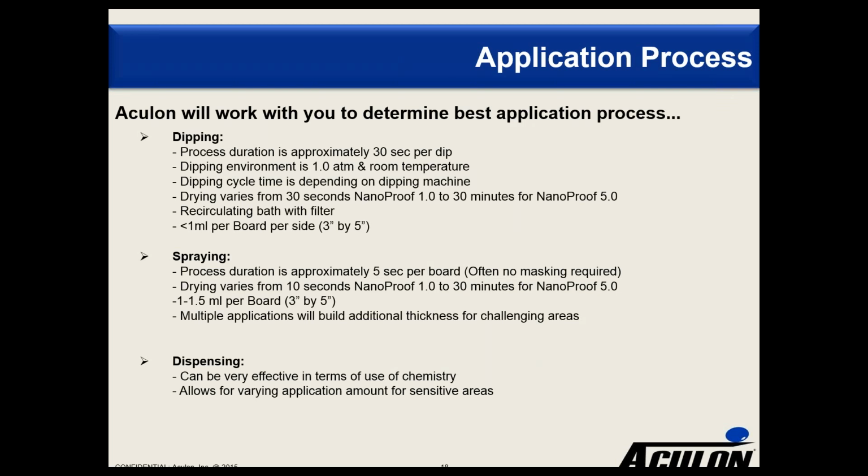Depending on the part to be coated and the manufacturing process you employ, NanoProof series is adaptable to dipping, spraying, and dispensing. Dipping is typically done with a 30-second dwell time at ambient conditions. Drying time varies by the NanoProof solvent, and we recommend a recirculating bath that is filtered for dipping operations. Depending on how populated your board is, we find that typically less than a milliliter of coating solution will coat a 3-inch by 5-inch board. Spraying can be accomplished with no to minimal masking, depending on the formulation used or your equipment, and cycle times are short